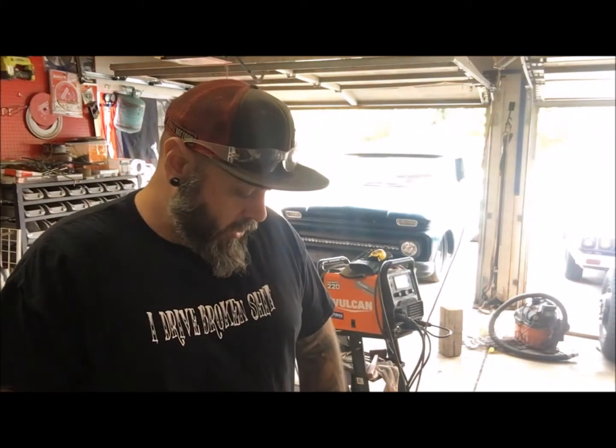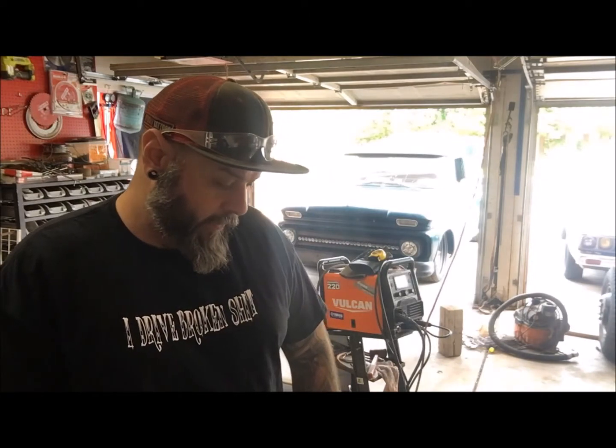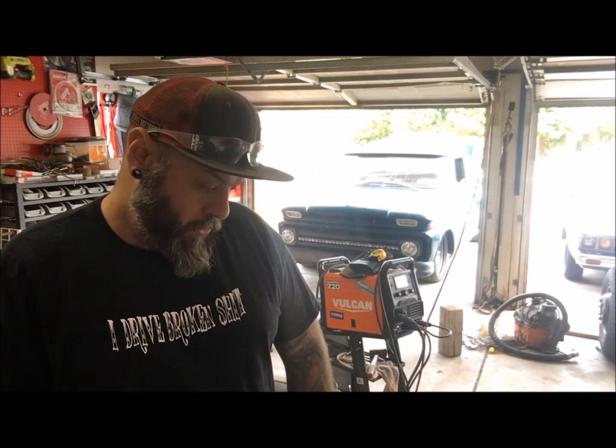I did that little bit of welding the other night on the frame. Started to kick up to go over the axle. I'm cutting it pretty close on it, but it's going to add more and go higher. But the fact is, we've measured these tires and they're actually 245/75/16, and when we measured the body, it's going to put the top of the tire like 2.5 inches from the third window. If we ever went any higher, it would be up past the windows, and it's not what I want, because with the suicide doors, if we go too big, the doors won't open.